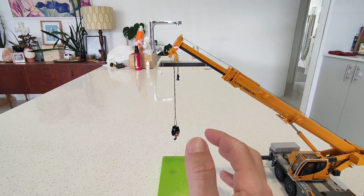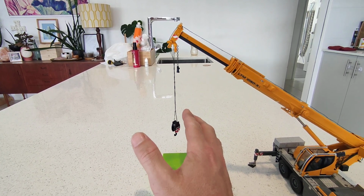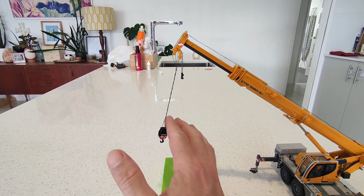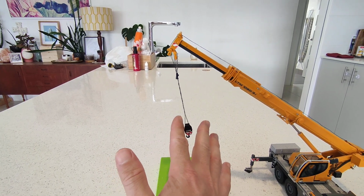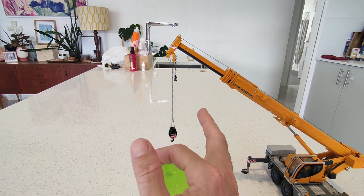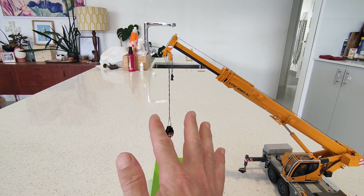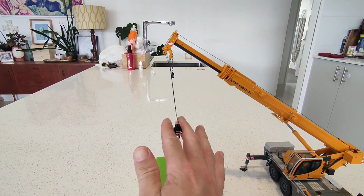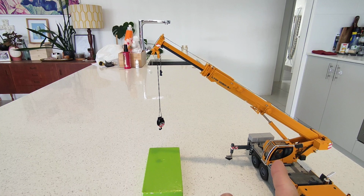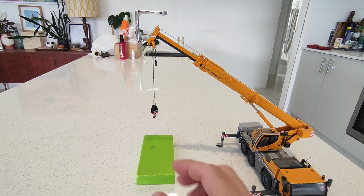So what happens is, this is what I do, alright? If you want to go with me, I'll get the chains tight and I say bring up about 2 tonne. And as he's bringing up about 2 tonne, if the ropes go out like that, I know I'm under jibbed. If the ropes go out like that, I know I'm over jibbed. And what I'll do is I'll jib them up until this goes into the centre, maybe come down on the hook again, and then when I think it's right, I'll come back up on the hook, and if there's no movement, front or back, that's his centre. And then I say to him, that's his centre, bruv, and then he'll check his radius and lift it off his radius for the whole time until the load's lifted up. That's his job. I've picked it straight. But that's how I do it.